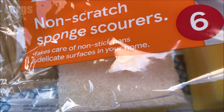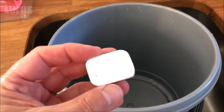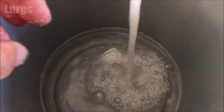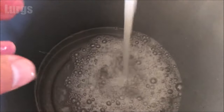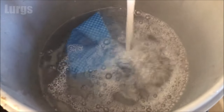Whilst it's draining, for cleaning you'll need a nice lint-free cloth, a non-scratch sponge scourer, and a bucket. Don't be tempted to use washing up liquid because that will bubble and you'll get loads of foam everywhere. The best thing to use is a dishwasher tablet because this won't foam up — just pop that into a bucket, fill it with hot water, and give that a good swish around so that tablet dissolves. Once that bucket is full up it will be ready to help start cleaning the spa.